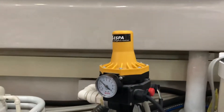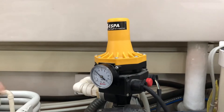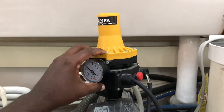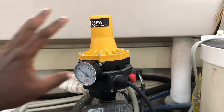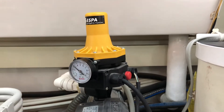There are two types of pressure switch: one is a mechanical pressure switch and one is an electronic pressure switch. This is a kind of electronic pressure switch, but it still uses a mechanical spring-loaded diaphragm inside to calibrate the pressure. So this is a combination of electronic and mechanical.